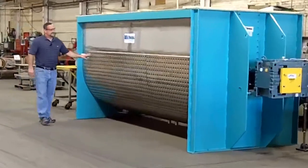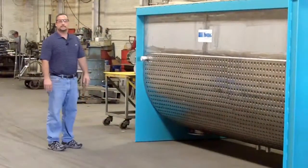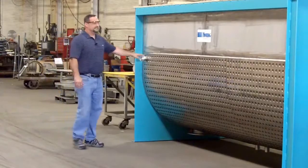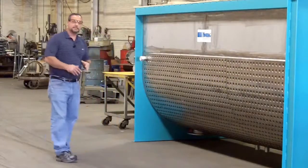This is provided with a stainless steel heating jacket designed for 100 PSIG — it is an ASME code vessel. We have inlets on either side at the top and discharge at the bottom, and it is a split jacket.